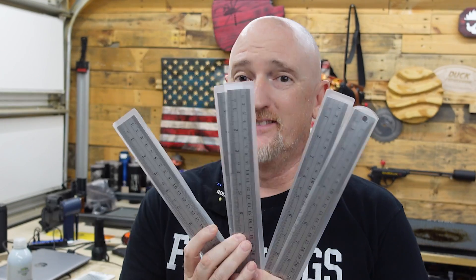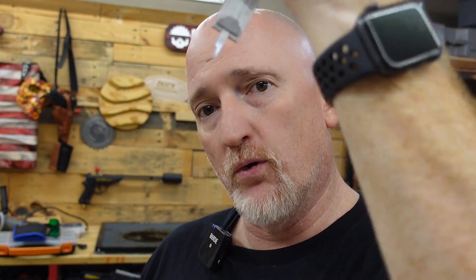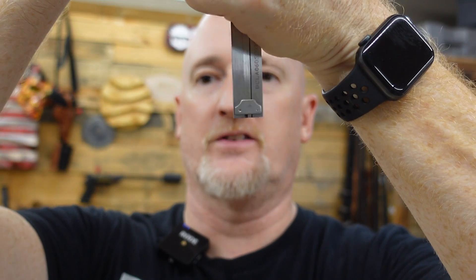I like to have some measuring tools in the shop. I have little rulers that are metric on one side and imperial on the other — I lose these all the time. I also have a cheap pair of calipers. A lot of times I want to know the thickness of the material I'm cutting. You can open the jaws to measure, but you can also use the depth rod on the bottom to measure how far you are from a surface, which comes in handy for focusing.